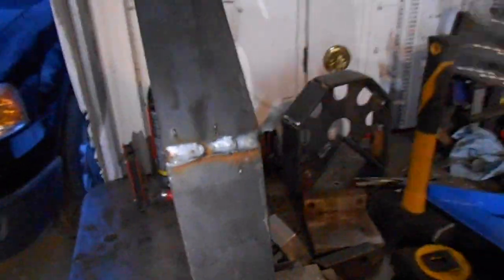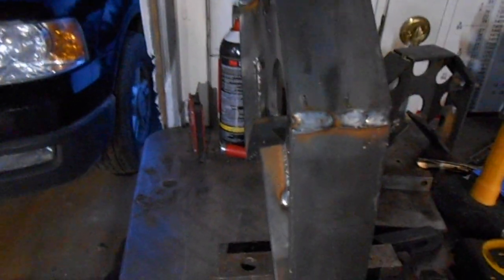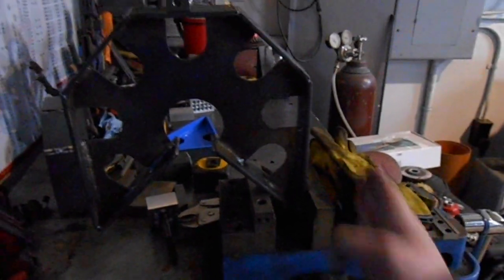I'll go and touch that all off before I square it up. I'll probably use the one, two, three blocks running around it again, just to make sure when I have it bolted or flat on the table, I'm getting contact. If you put a flashlight behind these and you have a slight edge, a little bubble, you see one side looks dark and the other side has a nice little light shining through. So when I have these down on the table, I'll put one edge of the surface down and be able to see that a lot clearer. The way this is designed is that when this is flat and you grind these two to the right height, both of these points are at 12 inches down, and you also have 12 inches across. You could look at it as a welding's equivalent of a 12 inch parallel.